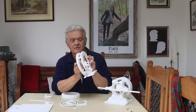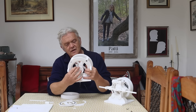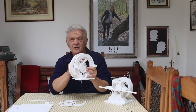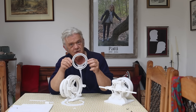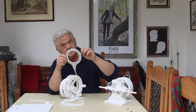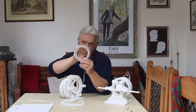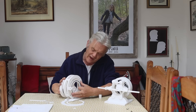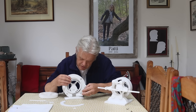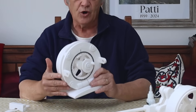Everything's the same — I reprinted the center as well. The cap goes on the back of the center, the drive gear goes in there, and the flywheel goes on the back. That whole section assembles in the same way as the original engine. The gear has changed though: this part is identical to the original, but it's now got an outer ring on it. With that outer ring and the worm gear, I can change where that outer ring sits. On the outer ring I've put degree marks — 360 of them. It slots in the space and has a cap to go over the top to hold it in place. The worm gear goes in the little slot at the bottom and has a driving axle.